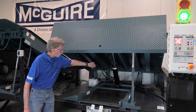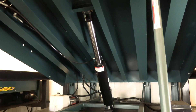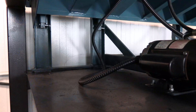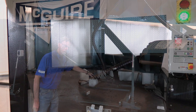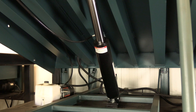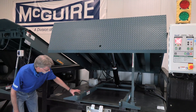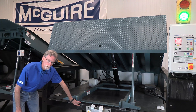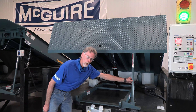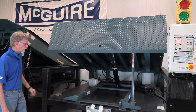You can see that we've got four uprights in the back. Underneath those four uprights, shimming is required. Not only do we shim the four uprights in the back, the hoist cylinder area as well is very critical to be shimmed. In the front, we also have what we call the front angle. You can see this is the lip keeper. We shim underneath the lip keepers on both sides. And in this case, we have the maintenance prop area.